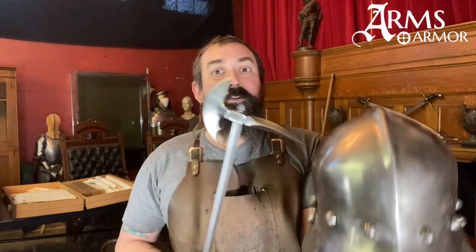One of the things that we learned is that even a hardened spike has a hard time going through armor that's shaped, because one of the things that armor does is deflect blows. Here's this helm — a blow that comes in tends to skate off of these surfaces rather than just grabbing and punching through like it might on a flat piece of metal.